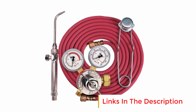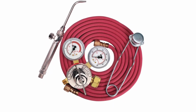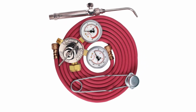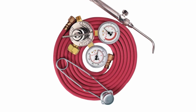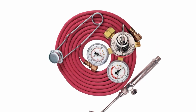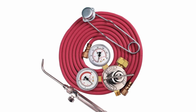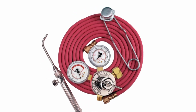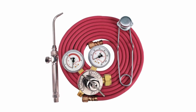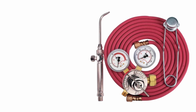The Handy Torch is engineered for use with acetylene and oxygen, delivering a fine, adjustable flame suitable for delicate silver soldering or brazing applications. It provides precise flame control, which is essential when working with small parts, detailed metalwork, or heat-sensitive materials. The torch head is compact and ergonomically designed, allowing for comfortable, fatigue-free use over extended periods. Included in the 239-193 outfit are several key components: the Silversmith torch handle, hose, single flame tip, and regulators for oxygen and acetylene tanks.